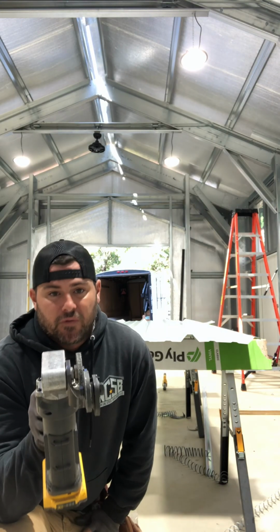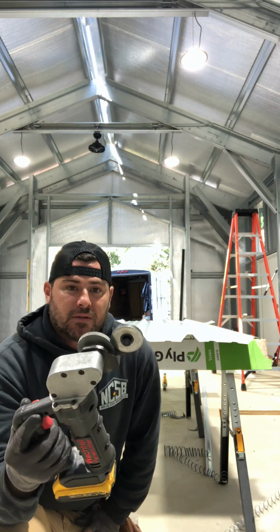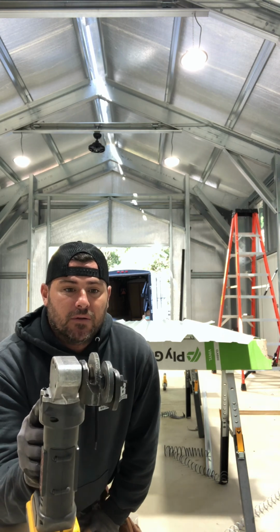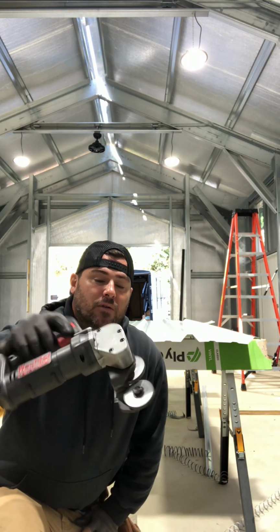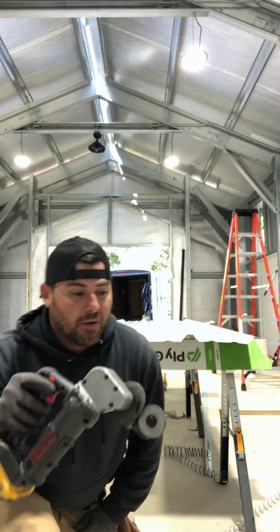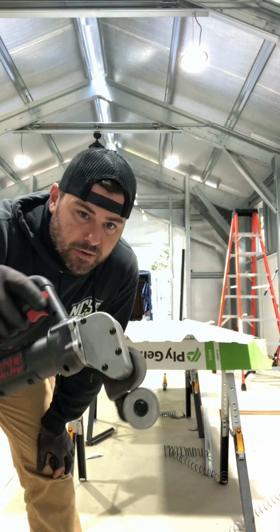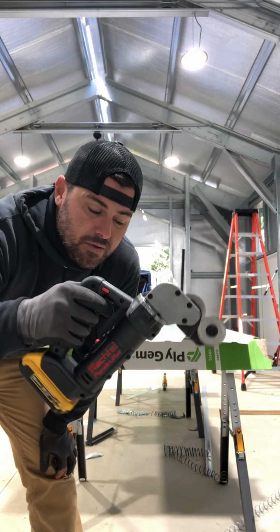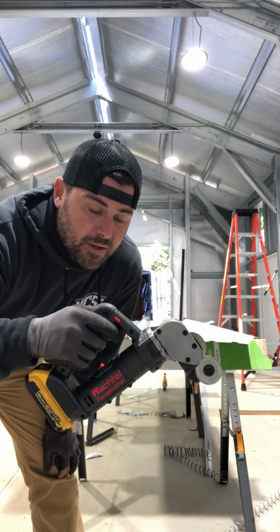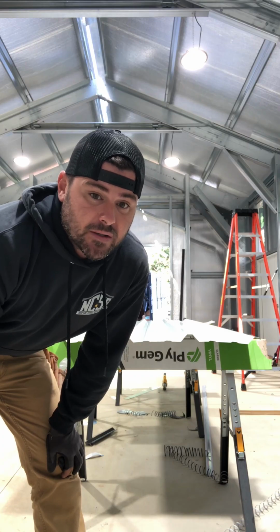If you guys are even familiar with sheet metal work, you'll know this is basically a handheld slitter, and you do have to have some dexterity. It kind of wants to turn around, fold this way and that way, or do this number on you while you're going straight across. That's what this variable speed's really cool for. You just slow down where you anticipate something like that happening, and you can make a pretty dang straight cut with it, and it's clean.